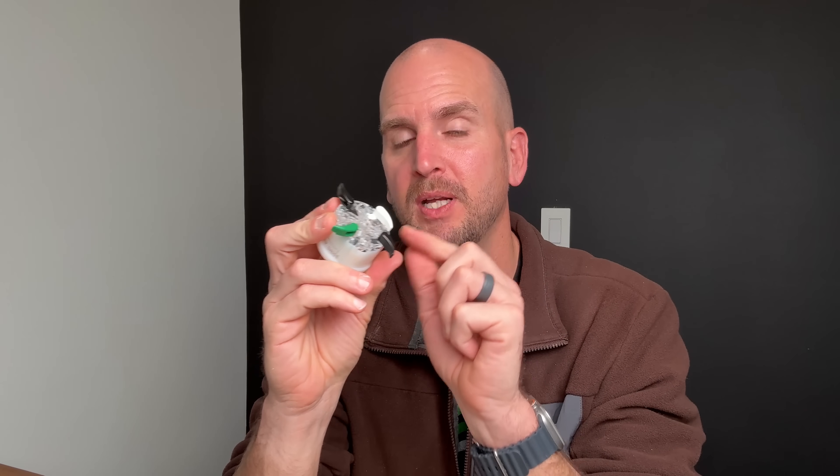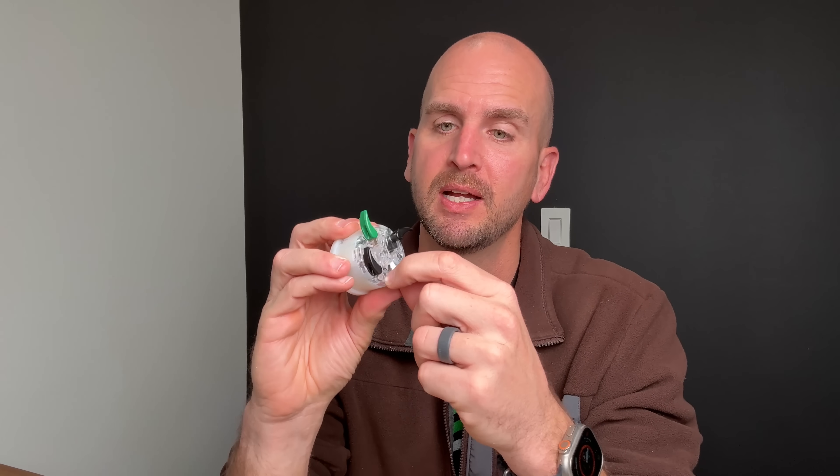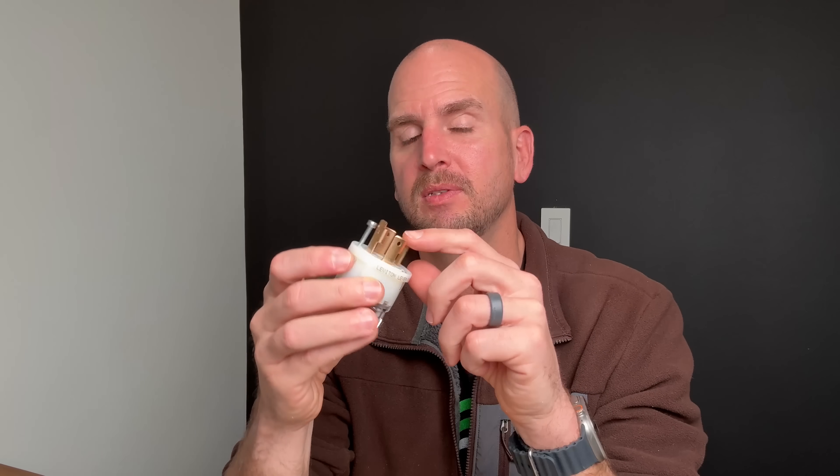Leviton seems to be rolling this across all sorts of designs — you can even see a 240-volt 30-amp plug with built-in levers. This is much better than the small screws we usually have to tighten, which people classically do not tighten to the correct torque. With stranded wire you have to work and torque multiple times to ensure a secure hold, so I think these springs are a better long-term solution. If you want to see a few projects using this type of plug, check out the linked video where I show how to back up your home with a portable power station and a generator inlet installation. Thanks for joining me, and we'll catch you on one of those next videos.